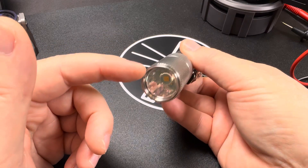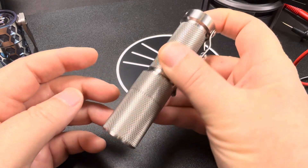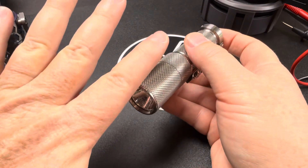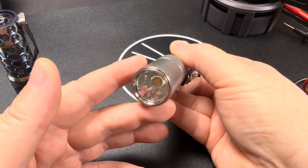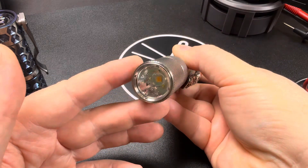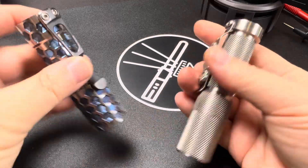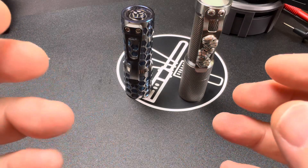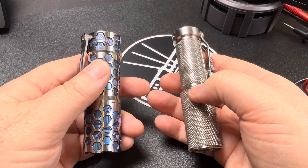Just to wrap up, I'm going to clean up my light by removing the second mode that I added. If I press, that's the first one. Press, that's the second one. I'm holding for three seconds to lock it in. Now I'm going to go to programming mode — five to add or remove, and two to remove. Programming mode — one, two, three, four, five and one, two. Now I let go — low, and I'm going up. So that's how you program it. I hope that makes sense. Sometimes just talking it through and showing it will help. Godspeed — as I said to you in messages, you cannot destroy the driver by tapping too much. So just tap away, it's no big deal.